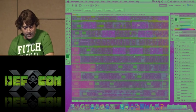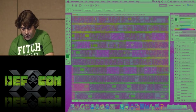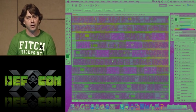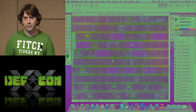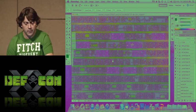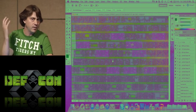So following these lines led me over here to these beautiful blue boxes. There's only 2 spots in this whole chip, just stepping back for a second, where these lines went to inputs. Every other place these lines went to were tri-statable outputs. So out of 16 places I traced it to, 2 were inputs, and 14 were only output capable. This is because this is a unidirectional bus. This is basically the TX side, let's say, and the RX side.